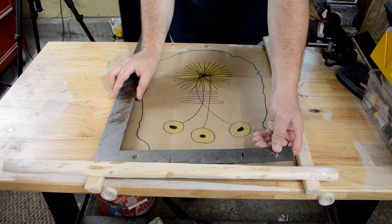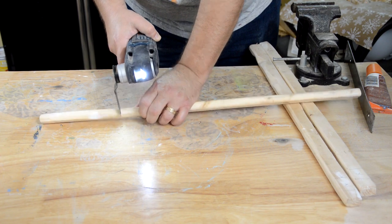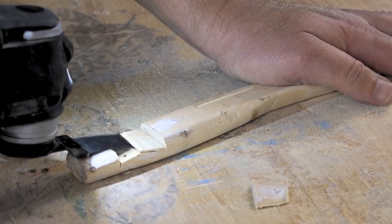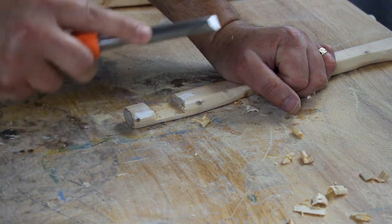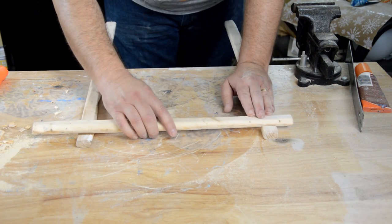To finish the frame, I'm using a template I made, and that will help me measure how far apart I want those uprights. Then I can measure where to cut the upper crossbar to length, while also marking where to cut the uprights to inset that crossbar. I'm only notching the uprights so the crossbar sits proud of it. That's just an aesthetic decision, not structural. In fact, I'm simply screwing these pieces together because the base will complete that whole structure, making it much stronger.